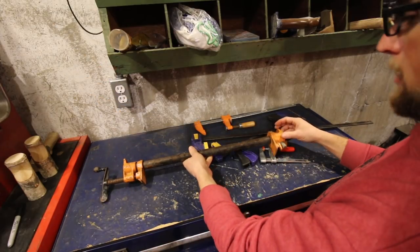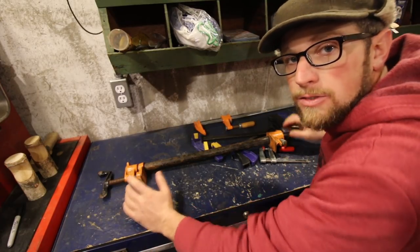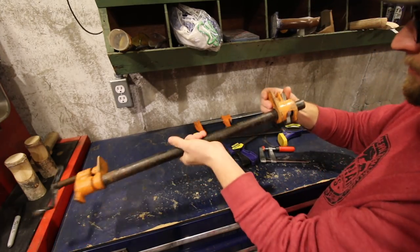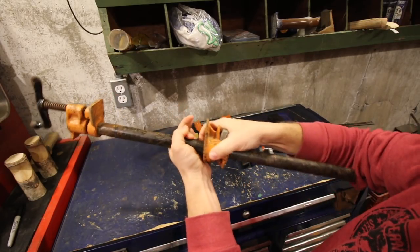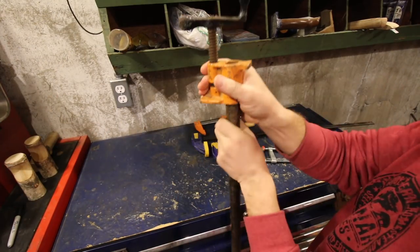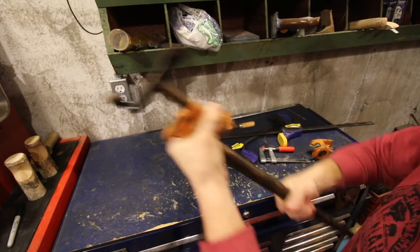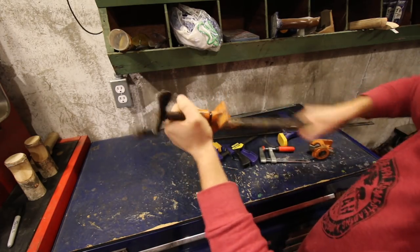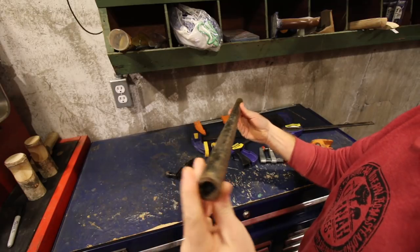The pipe clamps are nice. We have a two-foot section pipe clamp. These clamps you can make as long as you have a piece of pipe for — you can go to the hardware store and buy threaded black iron pipe. One end has a lever that slides; when you let go of it, it locks in place, but you can always push it up. The top end threads right onto any black iron pipe, so you can get whatever length you need.